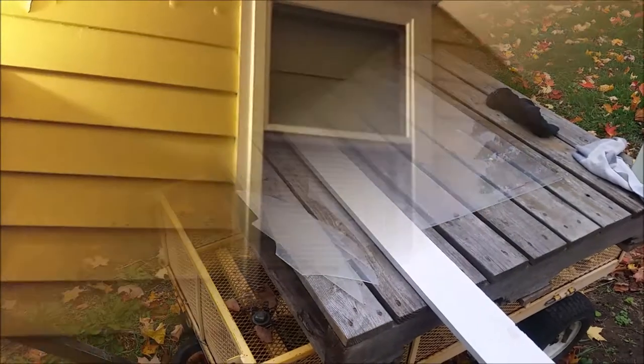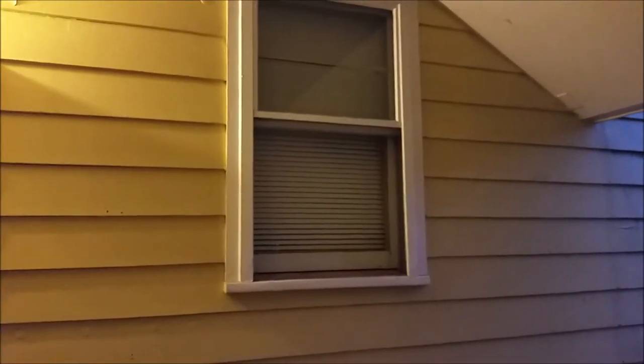I've been painting and working all day long and the daylight is getting away from me. The first thing you want to do is use your utility knife to go around and scrape these edges to try to get some of the debris — you get a lot of dried, caked-up caulk in there. There's a channel at the top, and you want to make sure there's no broken glass up there, then you can slip the glass right up in there.